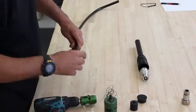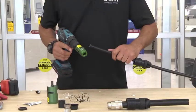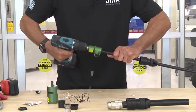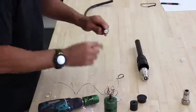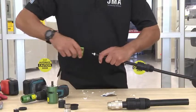Take your rag to remove any dielectric grease that may be on the cable. Take your SP540 prep tool and insert the cable into it. Make sure the center pin is chamfered and make sure there's no dielectric on the center pin.